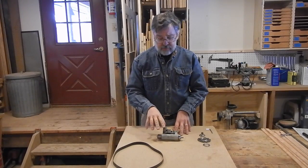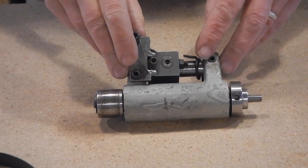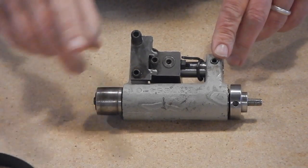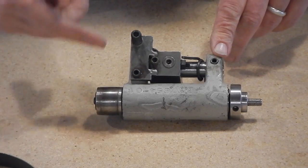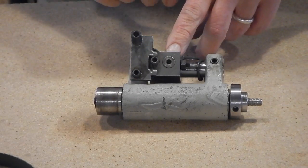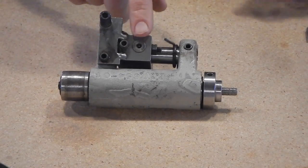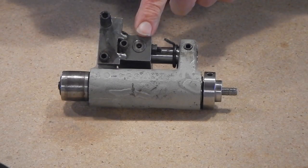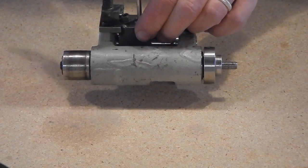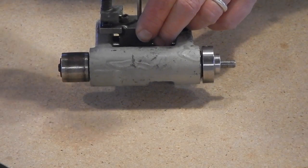Here's the scoring assembly on a surface that I hope will allow you to see it more clearly. Just to orient you: the saw blade gets mounted here. This flat pulley is where the drive belt goes to drive the blade. This block here has the three control points that you access through the surface of the table saw. The control point to my left, your right, is where you can adjust the scoring blade, moving it left and right, so that you can line it up with the main saw blade.